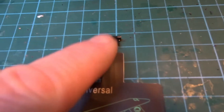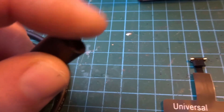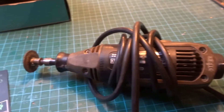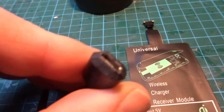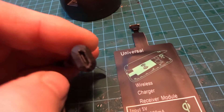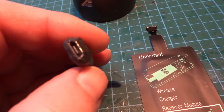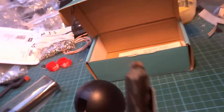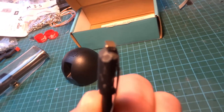My first problem is getting that tiny plug to fit in there. I'm going to have to grind back all the plastic around the plug because it's very short and otherwise it won't fit. To do that I'll use my trusty Dremel with a grinding disc. I've carefully ground away the plastic so it's now exposed — obviously you don't want to get bits in there because it's a female socket. I also slimmed down the underside slightly with a file, and it does go in.